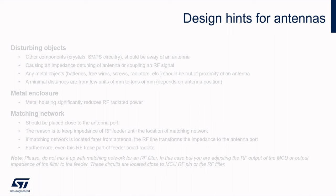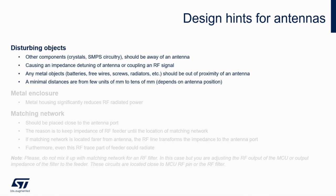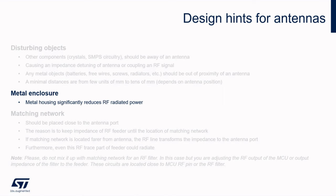We can imagine the antenna as a radiating element that can simply interfere with other routes and components. The more sensitive the circuit, the more consequence it could have. This is about very low power signals and high frequency signals, and about power supply as they are directly connected to the RF part of the transceiver. But it may be an issue in the opposite direction as well — disturbance could come from different signals to RF, for instance to the receiver. Any metal object placed in proximity of an antenna acts as an obstacle or can make the antenna impedance mismatched. A particular form of effect will depend on the size of the object. What is important is not to use a metallic enclosure because it is a really huge obstacle — the radiated power will be completely reflected if no free space is present at all. You must provide an area where the antenna can radiate through.